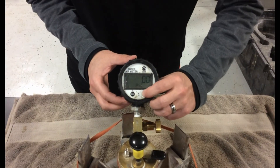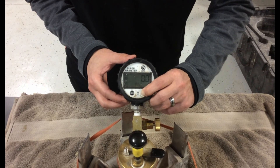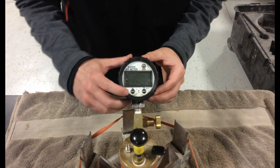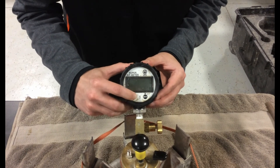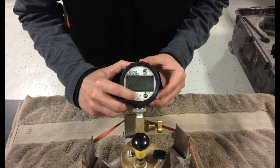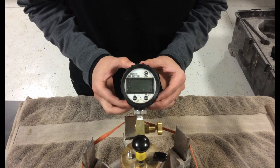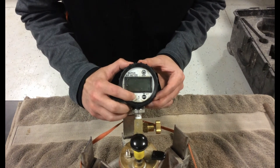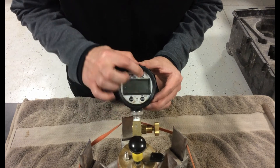The SAM gauge has a menu system for ease of use. Press and hold the menu button for three seconds. The gauge will start flashing text depending on your previous entry. Use the arrow keys to navigate through different parts of the menu. Cycle through the menu until the gauge starts flashing test, then press enter to gain access to the test menu. The test menu contains the type B test and the SAM test. Use the arrow keys to cycle to the SAM test and press enter.